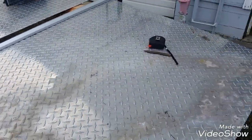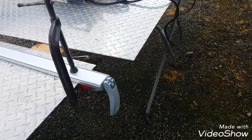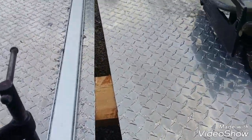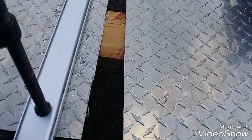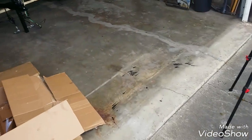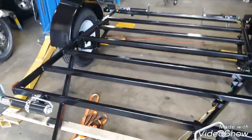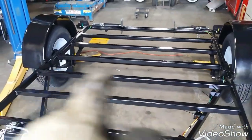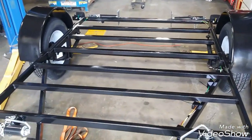You're going to need to use a real saw — I wouldn't use a cordless or something, unless you've got a cordless saw better than mine. Anyway, that's it — we're cutting the aluminum today. I'm going to just clean up that edge a little bit with a file. And I'm going to put some caulking down on the trailer on all of the cross members. Just whatever I've got sitting on the shelf — silicone or window caulk or something — so that when I screw it down it's like a gasket and it won't rattle.